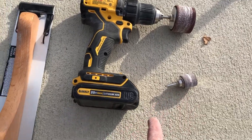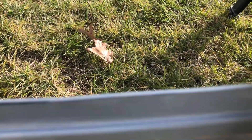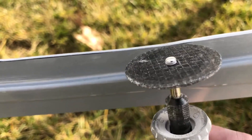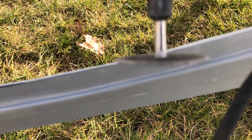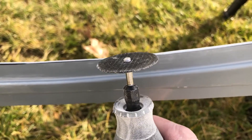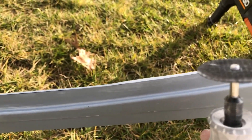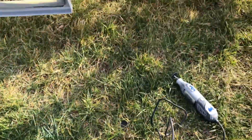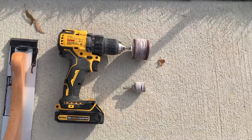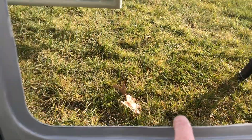In the corners, I first used my Dremel tool and cut it. What worked really well for me is when I was using this tool, I put it underneath like this. I found that it made it pretty easy to cut nice straight lines. If you do it from the top, it just jumps around a little bit. But if you do it from the bottom, it comes out a really nice cutting blade. I got those as a package at Harbor Freight — a package of three, pretty cheap. I cut it and got it roughly the way I wanted, even used it to cut some rough cuts around the corners. Then I took this guy and did some rough smoothing, and then the big drum really worked well for radiusing the corners and getting it pretty good and flat.